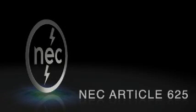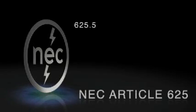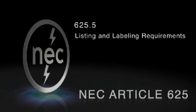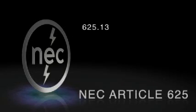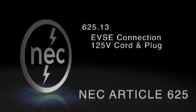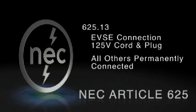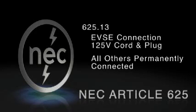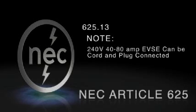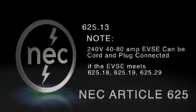Some of the key tenets of Article 625 include 625.5: all electrical materials, devices, fittings, and associated equipment are required to be listed or labeled. 625.13: Electric vehicle supply equipment rated at 125 volts, 15 or 20 amps, and listed as suitable for the purpose shall be permitted to be cord and plug connected. All other electric vehicle supply equipment shall be permanently connected and fastened in place. It's important to note that 240 volt, 40 to 80 amp EVSE can be cord and plug connected as long as the EVSE meets the requirements of 625.18, 625.19, and 625.29.